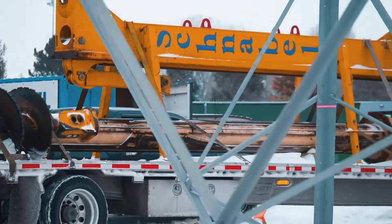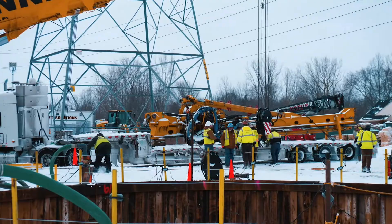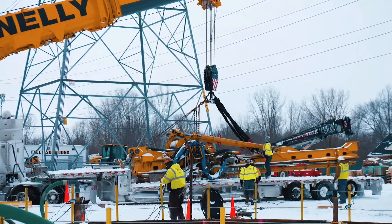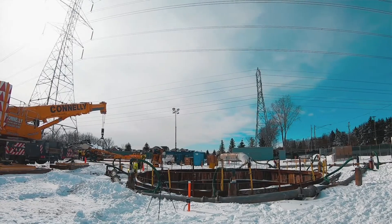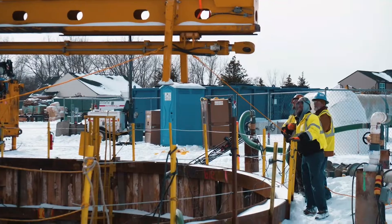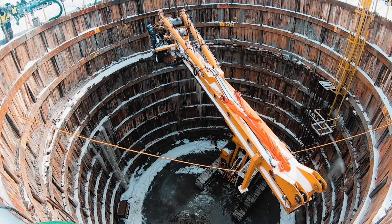After the base machine is down, we rigged up the lower mast section. On a standard job, the base machine would have come in with the lower mast section already attached. We had to work for several weeks with the manufacturer, and we did a test pick with it at our equipment yard prior to it coming here. We had to change up a few things based on the manufacturer's recommendations, so when we got here we still had a little bit of trial and error. Our initial plan coming into this was to lift the mast at ground level, get it on the angle we needed, but the constraints of the power lines meant we couldn't get our boom tall enough.